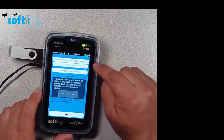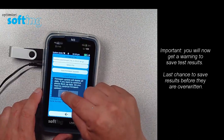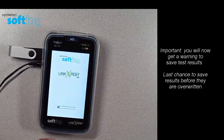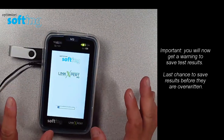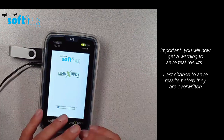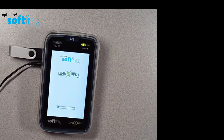It's going to give you a warning that all the test data will be deleted. I'm okay with this, so let's go ahead and proceed with the upgrade. The actual upgrade procedure is going to take anywhere between five to ten minutes. You don't need to do anything to the device — don't pull out the USB stick, leave it powered up. It'll go through the process and you'll see the boot screen appear and reappear a couple of times, and that should be it.